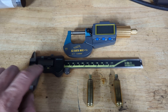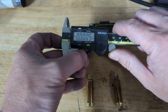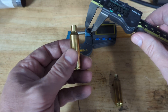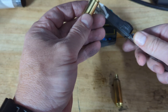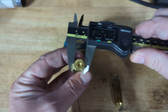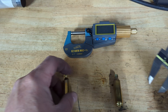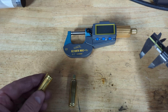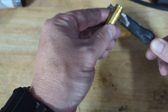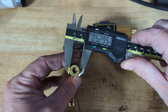So I'll power on the Mitutoyos — we've got that zeroed. Taking the virgin brass, unfired, and positioning the calipers roughly where the .200 line is: we're getting a reading of 0.5280. For all intents and purposes, that looks pretty good. Likewise, with the fired piece of brass that has been resized a number of times, I've got a good line here on the .200 line — 0.5295.